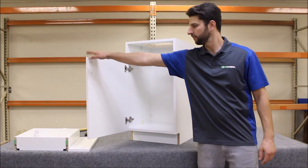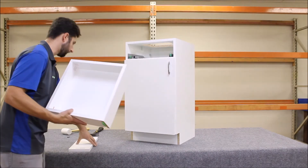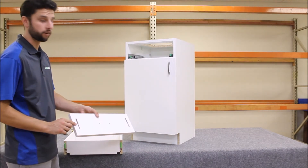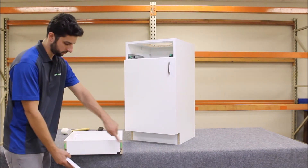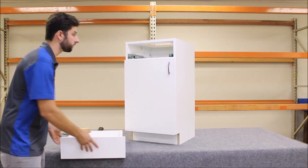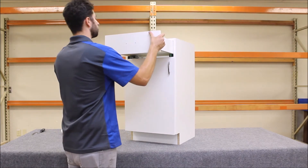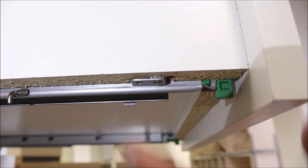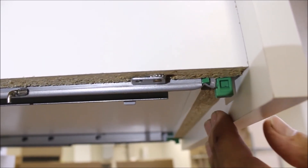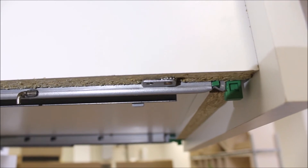Next we can install the drawer box. We have our channel lock drawer box already built and ready to go, and our drawer slab which has the keyhole slots routed in it. You're going to align those with the two channel locks on the front — it slides from the top down. Once you lock that in, make sure your clips are released on your drawer slides and simply slide the box in until it drops into place. Before you start making adjustments, make sure this little wheel right here is all the way down — that's an up and down adjustment for the front of your box — but all the adjustment you're going to need is in the fastener that attaches the drawer slab to the box.